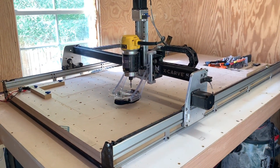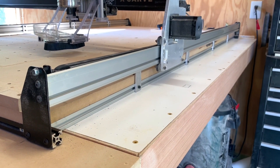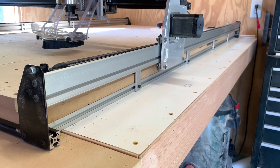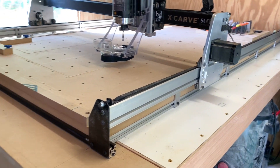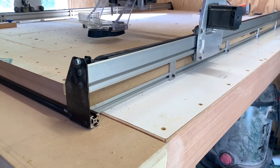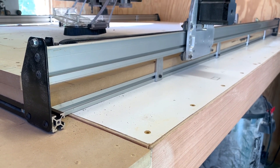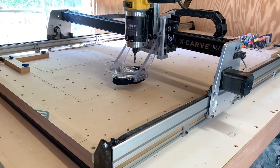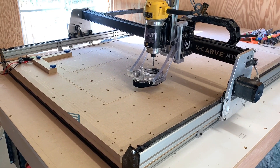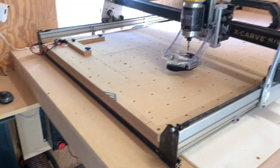I will also leave a link in the description from each vendor that I purchased these parts from. Starting off, the very first thing you'll notice is that it's 1800 millimeters long. That's an 1800 millimeter maker slide that I had to purchase from Inventables — it requires two of those, one on each side. You also have to have your extrusions, so I purchased a set of those to go on the base along with more pieces to do the cross braces underneath the wasteboard. I believe I have three of them underneath there, not including the front or the back.